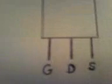Okay. Now, if you want to test a MOSFET, you can perform a few basic tests. Right, first we look at the MOSFET for signs of physical damage. Usually the drain gets discolored, indicating that it has become overheated. If it hasn't failed yet, it's a sure sign that it won't last much longer.